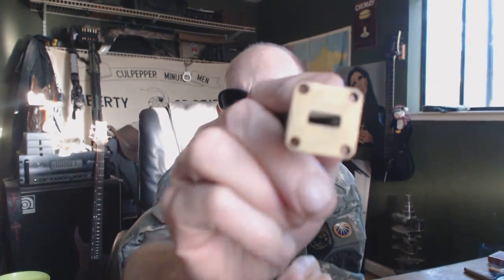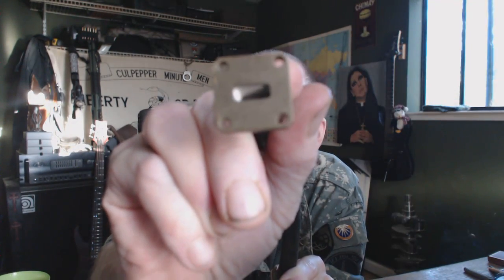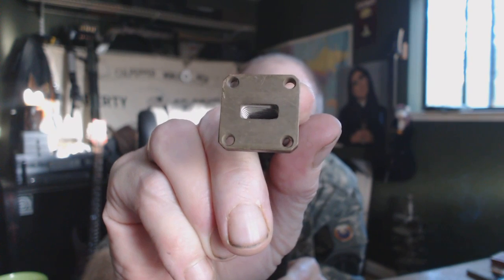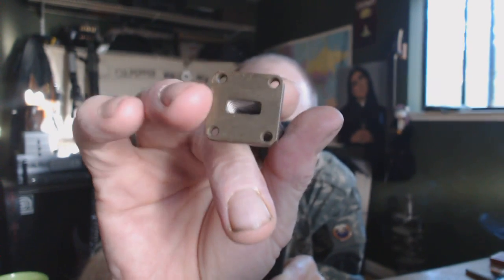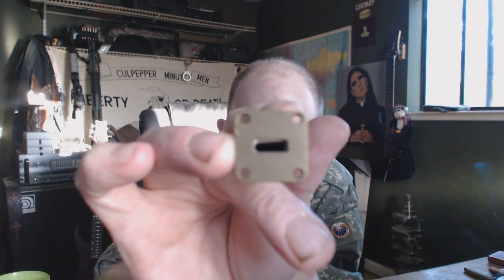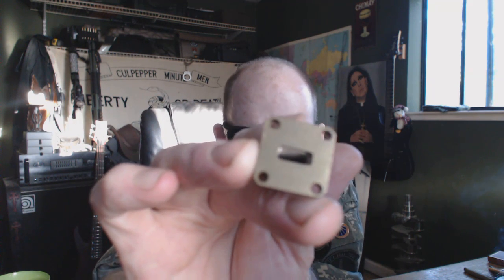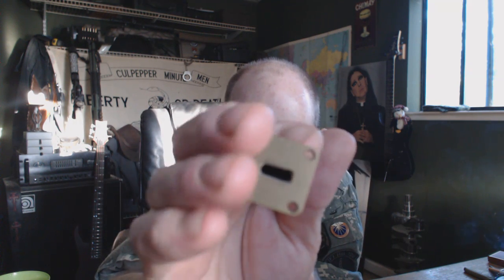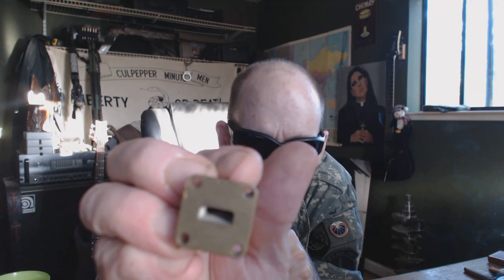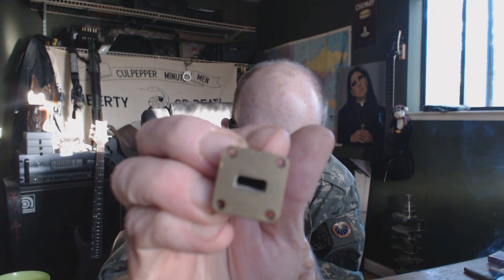As long as you maintain the bend radius on this, you can't be too aggressive with it or it's going to start getting lossy — that's a bad deal. Basically what this is: it's rectangular waveguide. You can see it's silver inside, and it's basically links like in a chain to form a tube. This is brass and all this becomes a ground field. You can think of the RF energy as a positive potential with electromotive force, being held within this ground field, kept inside the hole.